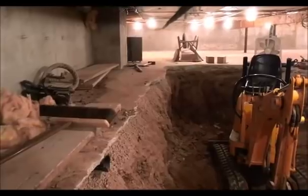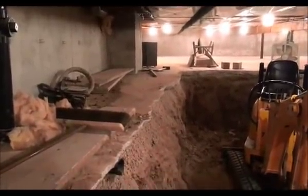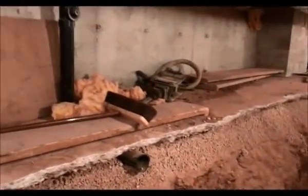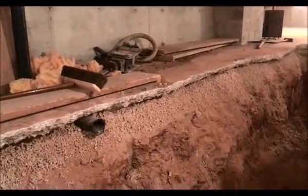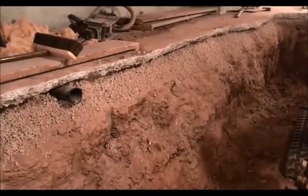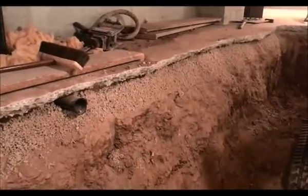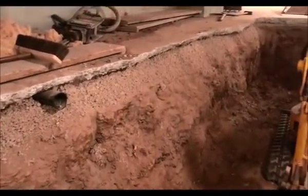When that's out, I go for the center of a wall, shore up the joist, and then take out a six-foot wide cut underneath the wall. At that point the wall works like a beam. I'll dig it out, put in five feet of concrete wall, tar, tile, and stone underneath it. Two weeks later, do the same thing on the other side of the basement. Then two weeks later, come back and put the next one.